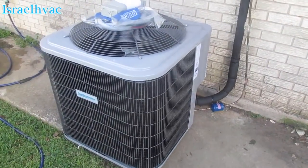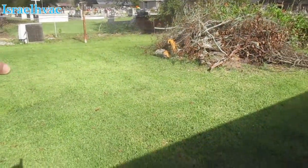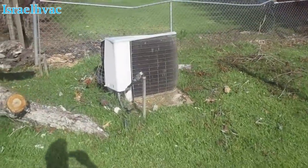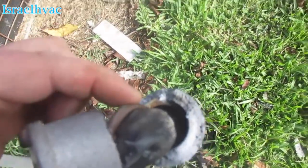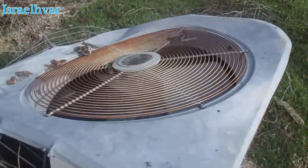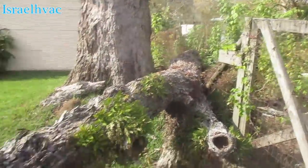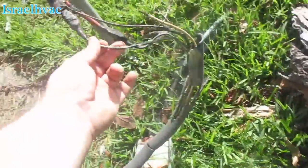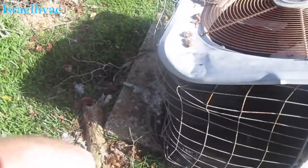It's done. Evacuated. Gas is cut loose. The low-voltage wire - I think it's inside. Yep, there's the low-voltage wire right there. That means he can bundle it all in together with the disconnect, and then we'll go from there. There she is. The old Amana got smashed up by that tree right there. Tomorrow I'll take my Sawzall and just start cutting - I'll snip this loose. The power's off. I'll cut those dryers out for him so he can stomp that down and bury it in the ground, and he can pick that slab up out the middle of his yard.